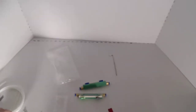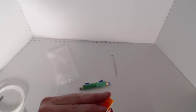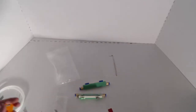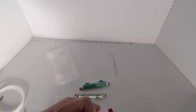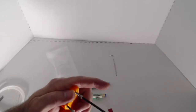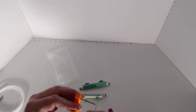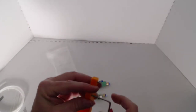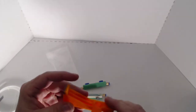The next thing to prepare is the two screw holes here. We're going to use our 16 millimeter screws and just screw them in from the back side. I typically will start this by hand — screw that in just like that — do the same thing with the other one, and then run that all the way through. I just want to run it all the way through to make sure we have it threaded completely. We'll do the same thing with the other side — just like that. So now we have our friction arm done; it just needs to be installed.